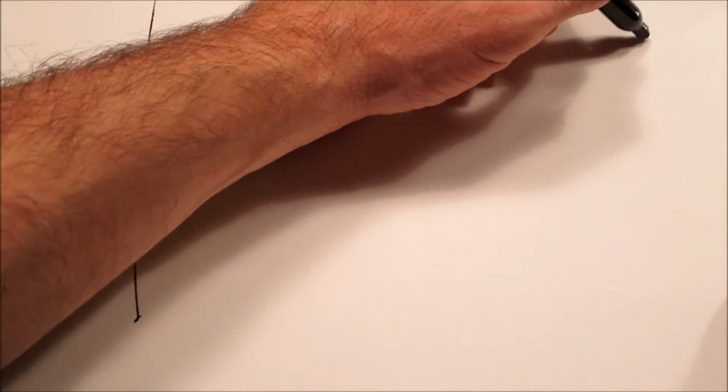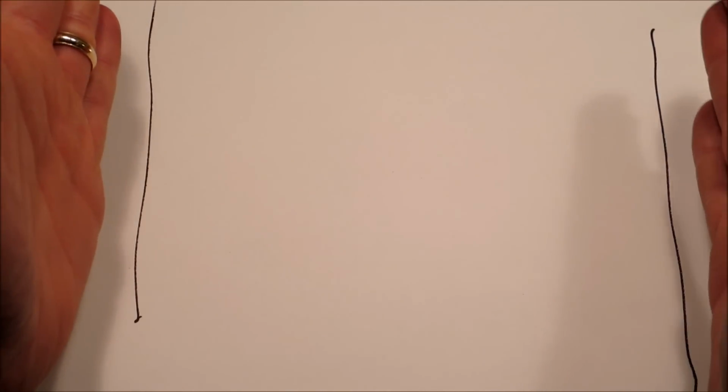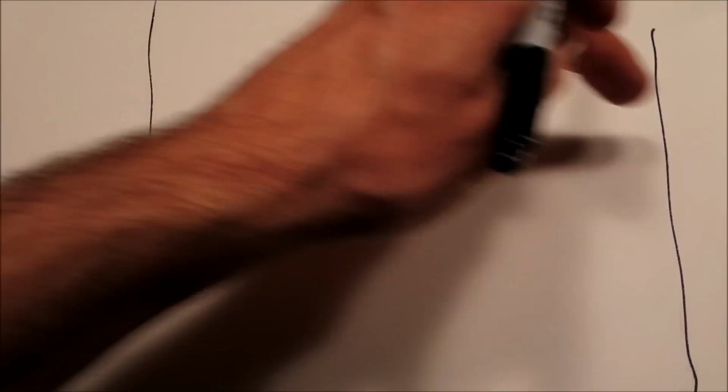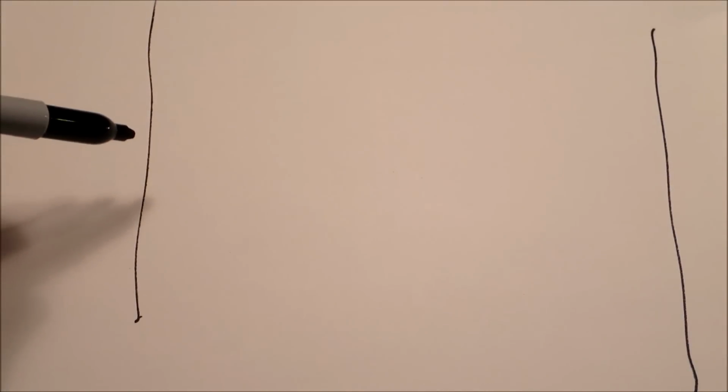So we'll work on the 25 volt side. We'll put in a couple lines. Again, this represents the difference of voltage potential on that generator. If you were to connect a wire across there, or hook a resistor across there, it would put 25 volts across that resistor and generate the appropriate current depending on the resistance of that resistor. Now we're using coils here, and let's draw in a little circuit.